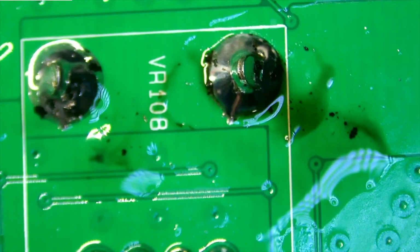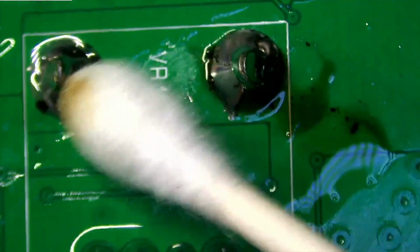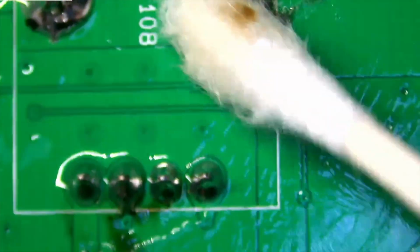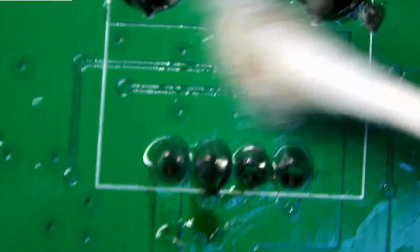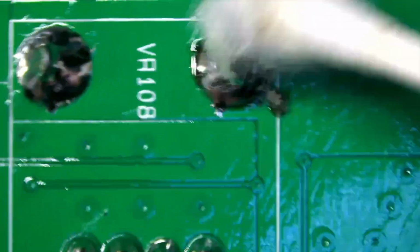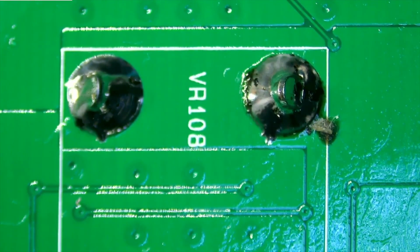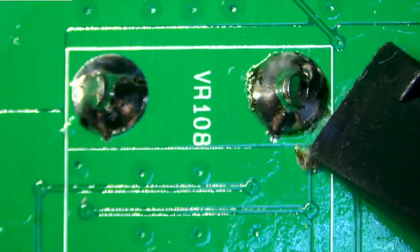Well, I know that we soldered everything on. I'm gonna just dab some alcohol up here and reapply a little cleaning solution, and I'll clean the little pieces of that up. We'll get that done, and once we clean the board, we'll put it back together and go from there. The little sticky parts like that I can't get with this, I'll use a plastic spudger, because you don't want to scratch the board. Just do that right there, and it's off.